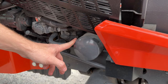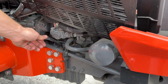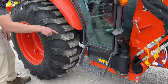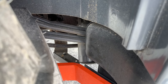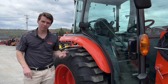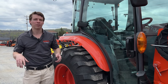Down low you'll see more grease fittings where everything pivots, and your oil filter. At 50 hours you do your break-in service: change your oil filter and engine oil, as well as both hydraulic and transmission filters. Your hydraulic filters are tucked up behind the fuel tank — you can see the canister back there. Change those at 50 hours to get all break-in debris out of your system. After that, hydraulic system oil every 200 hours; I recommend changing engine oil every 100–150 hours.